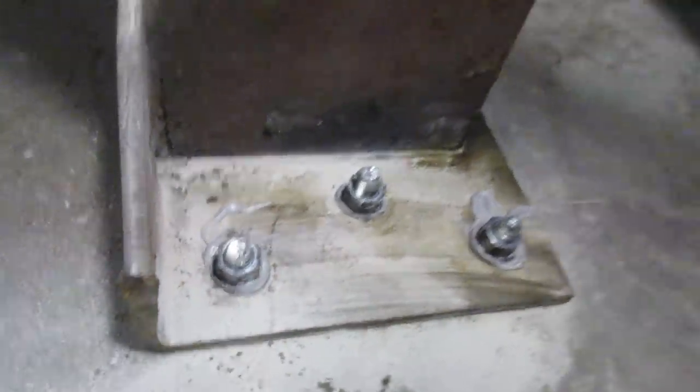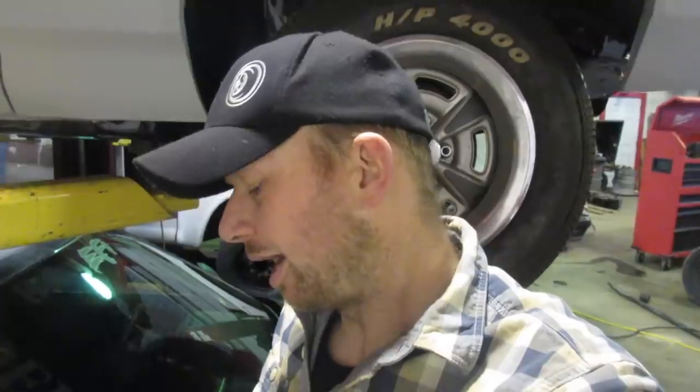Okay, so we got our bolts in. I ended up using a two-part epoxy rather than PL — trying not to get any on the threads or the nut itself, just put a little at the bottom of the hole and some around the bolt itself. The two-part epoxy from QuikRete is actually meant for anchoring things, and once those bolts are in, you'll never get them out anyway.